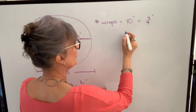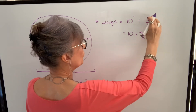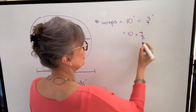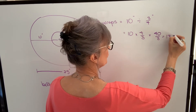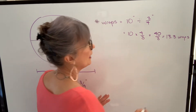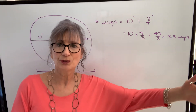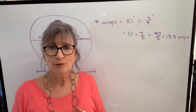In order to divide with fractions, I multiply by the reciprocal. Or you can change three-quarters of an inch to a decimal — 0.75 — and then take 10 and divide by 0.75. Either way, you should get 13.3333 repeating. I'm going to write it down as 13.3, but I'm going to use the full repeating value that I have on my calculator. So now I know how many layers, or how many wraps.